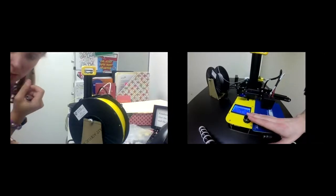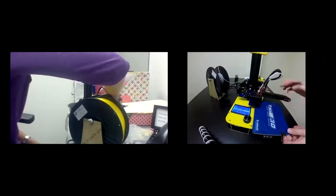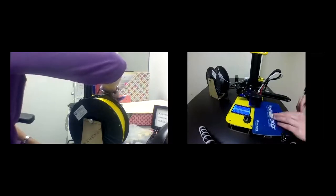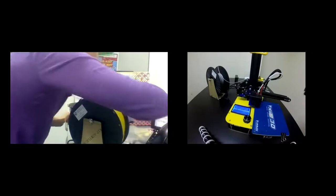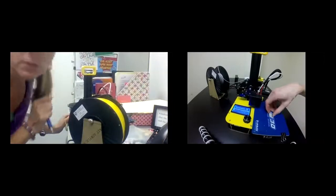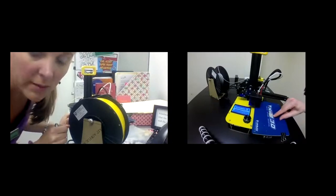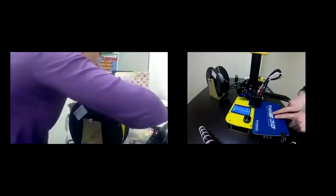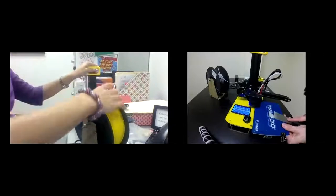There's a very, very faint block — so it was probably too close. If you didn't print anything out it was probably too close. Mine has a little block in the center. If you don't have spaghetti and don't have a block, then we need to re-level. When I re-level I prefer to use my eyeballs — the paper can be deceptive sometimes. I like to schedule the print and we'll use the key chain this time so it goes in a wider area.